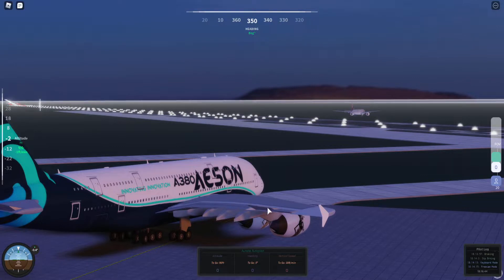Now the A380 has three ailerons instead of having one massive aileron. Redundancy issues — you can think of all the things that can go wrong in the plane, so of course splitting it into three makes the plane that much more safer. It also has the added benefit of addressing wing twisting on the plane's wing. Because of the outer aileron, at high speed — usually at 240 knots on the A380 — this aileron and the aileron on the other side will stop working, it will stop moving. That's because the wing twisting caused by that aileron in that area will start causing too much stress on the plane.